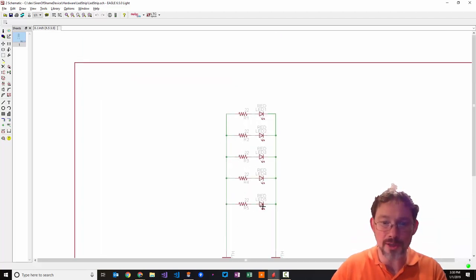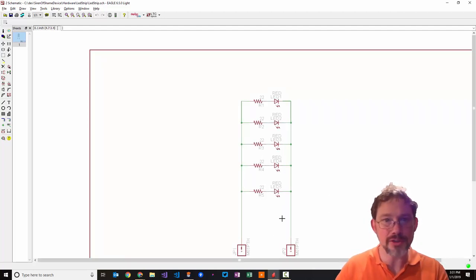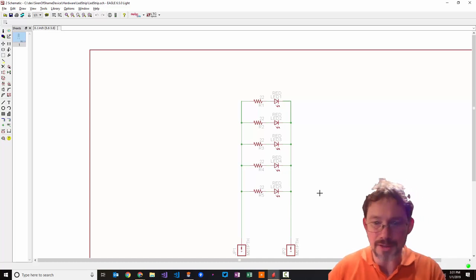So this is saying we're connecting up five LEDs with five resistors. We're hooking them all up in parallel, not in series, right? Because the electricity is going to go zoom up here and over here and over here simultaneously, and it's going to go through all of these simultaneously. And that's important when you're calculating resistance. Way too much, not worth getting into the details at the moment.